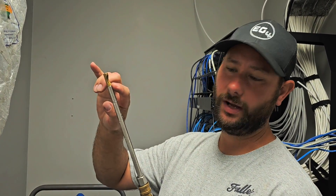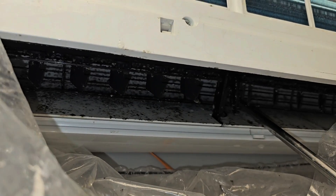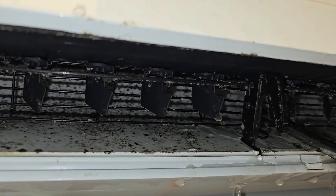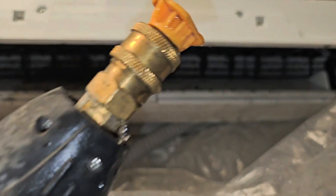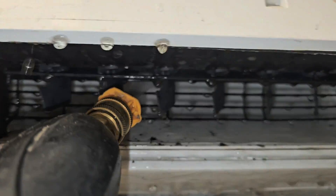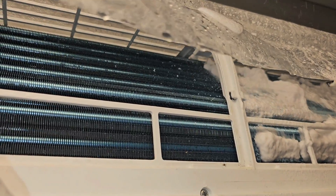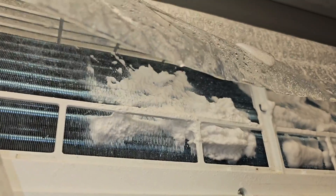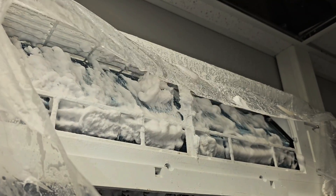This is a turbo tank, which lets you work inside a home without dragging in a water hose. I've also got a 90-degree wand here, and I'll place it inside and go up into where the blower wheel is to spray it. Make sure the bag is positioned so water goes into it. You can also use the 15-degree nozzle. Now we're going to apply coil cleaner all over the coil and the wheel.